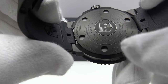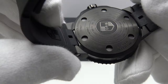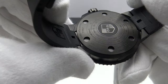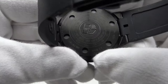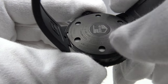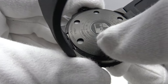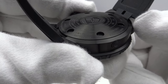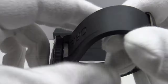Usually with PVD-coated and DLC-plated watches, watchmakers don't plate the caseback — they leave it in bare metal — because the friction of rubbing on the wrist, or in the case of a wetsuit, the rubber will rub away the DLC plating and reveal the bare titanium underneath. The DLC coating won't last on this caseback. It would have looked better and been more fit for purpose in bare titanium, although it does provide an effective hermetic seal to 1,000 meters.